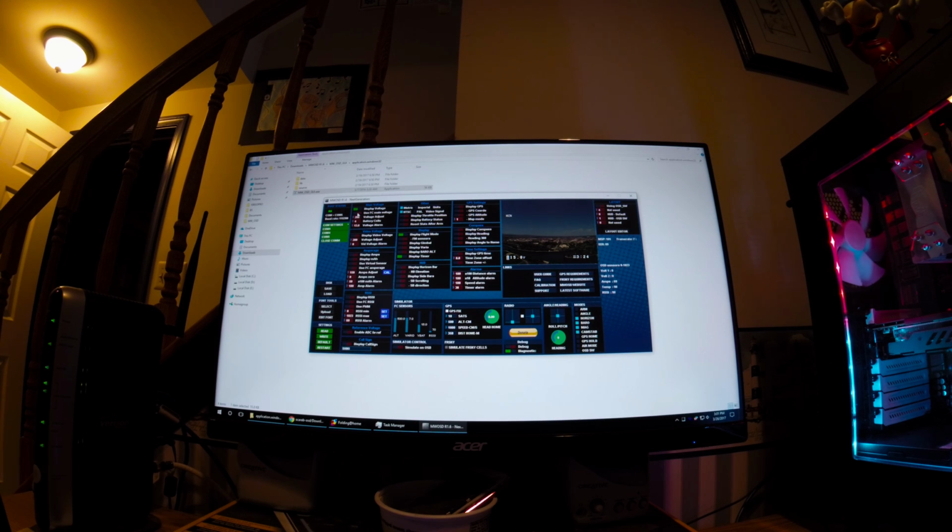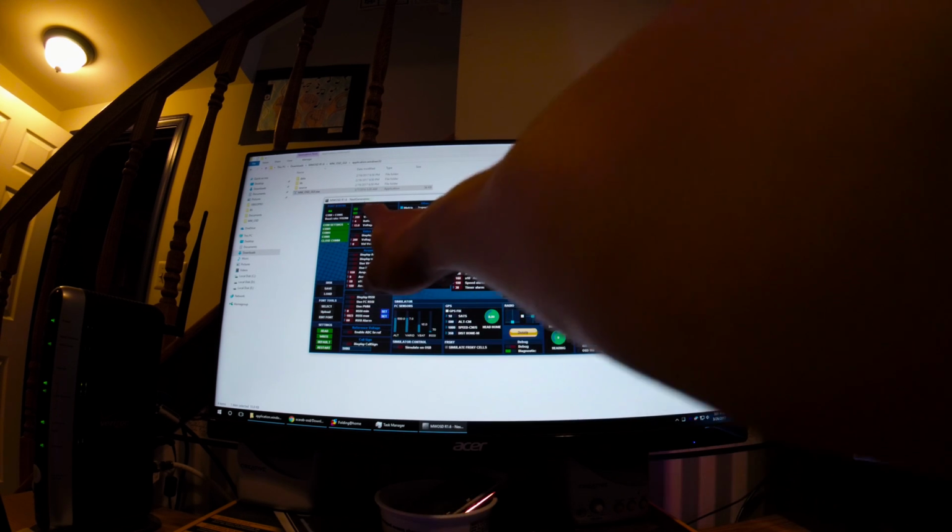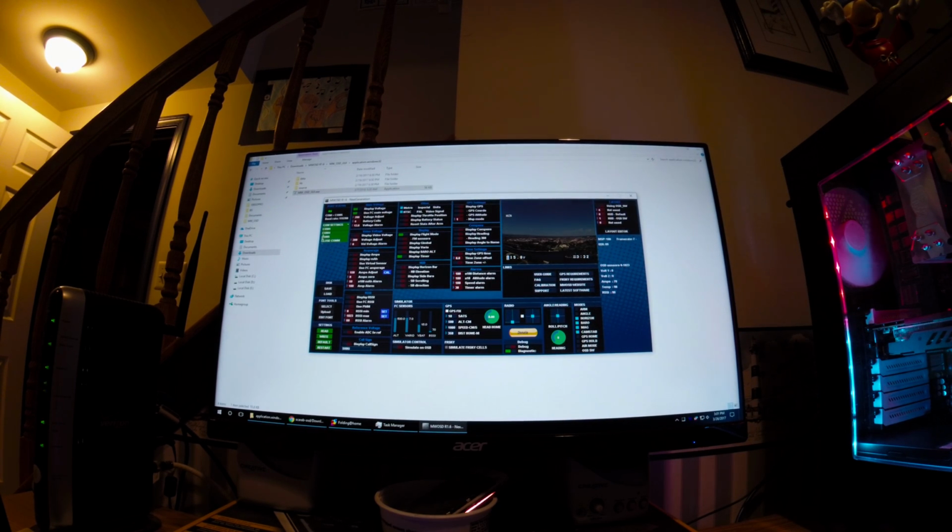So we have voltage here. I don't even know where it's going to get this from, so I'm going to say use the flight controller main voltage, and hopefully that will use whatever the flight controller is figuring out for the voltage. I'm going to leave the rest stock for the voltage adjustment and everything. We'll have to mess with that later. And then amps, display milliamp hours, and I'll say use flight controller amperage. I will have to see if this works. I will come back and tell you if it does or does not. And we'll leave the calibration the same, and we'll leave off RSSI.